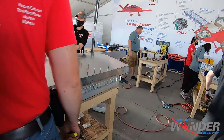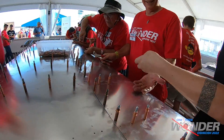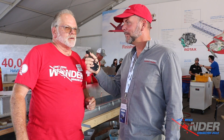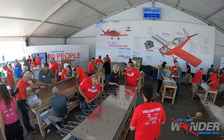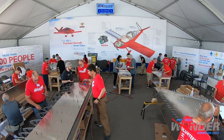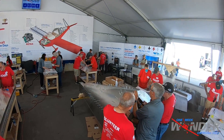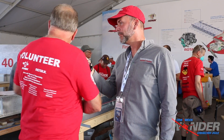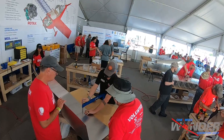There's been a lot of work on the wings today. This morning they were deburring both sides of the skins and the ribs. You basically have to assemble it all, drill out to the correct size, then disassemble it all, deburr, and put it back together before you can start riveting. Through that process they got one wing done, and the public is out there pulling rivets on it right now. It looks like there are signatures on one side, so they're on the second side — a long ways done.